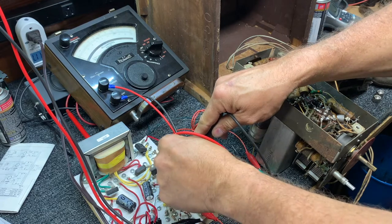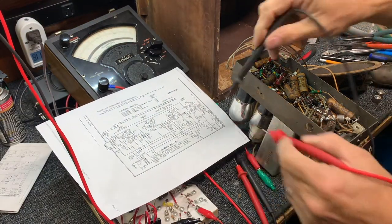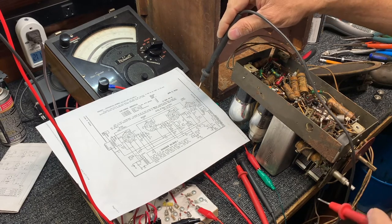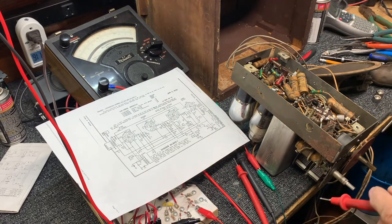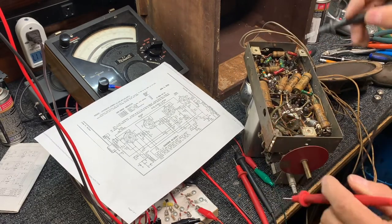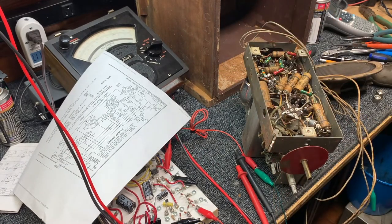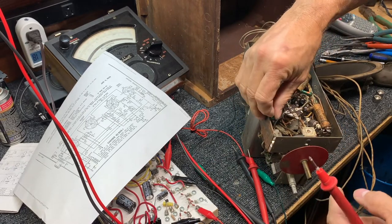We've got everything hooked up with the amp meter. The set's already turned on but we're getting nothing on the amp meter. Rather than piddling around with that, let's eliminate this from the circuit since we know the voltage is not reading correctly. We'll come back to it later. Let's just go ahead and plug the power supply in and confirm our voltage — 67 volts, 64 volts, close enough — and 4.5 volts, which is what we want.